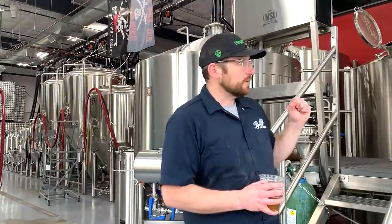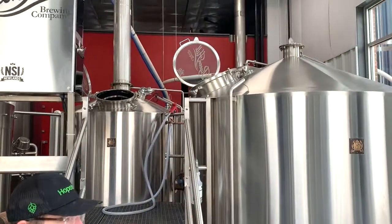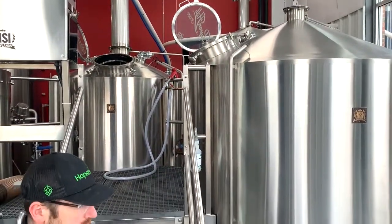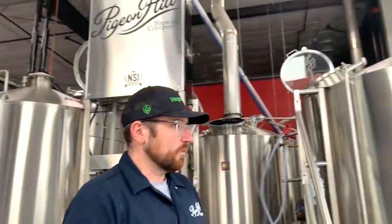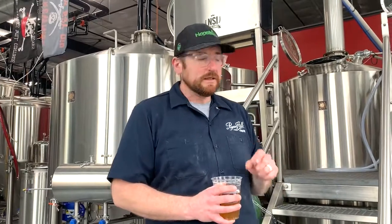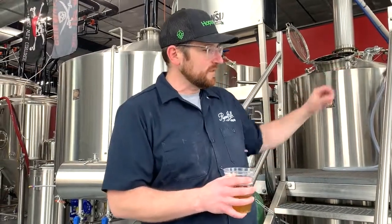and flavor the beer by adding hops. Then we pump over to our third vessel, which is a Whirlpool. Basically what will happen there is we will collect the wort in there, and it actually gets spinning. So it is centripetal force, I believe. It's either centripetal or centrifugal. I cannot remember exactly. But all these solids that are in the beer will get collected towards the center, and then we can pull nice clean wort off the side of the tank.